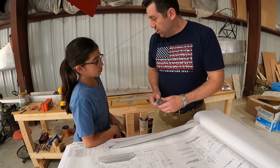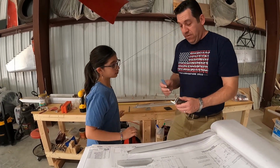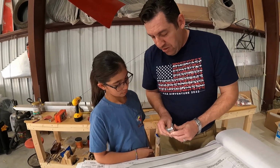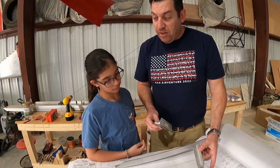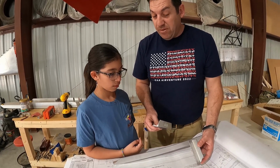So what we do is we cut the corner off at an angle and we put a shim. This is not our shim. But putting a shim in there will do something like this, so we still have a flat surface. And see how much closer we're able to make that? So when we cut that corner off to make our block, we have to look for details like that in the plans so we make sure we build the parts right and we don't have anything with gaps.